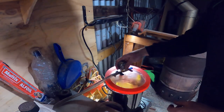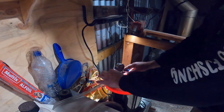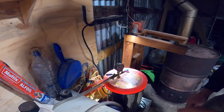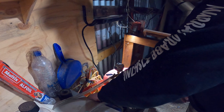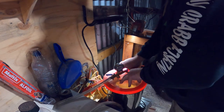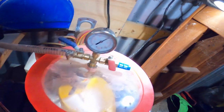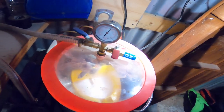So what we do is we sit the chamber on, open the inside one so it forms a vacuum. Turn it on, push down, and we have vacuum. You can see the needle going around, and we'll see bubbles start to come. Not that you can see through, this keeps getting dirty. But you see bubbles forming on the surface there. That's what's coming out of the timber.